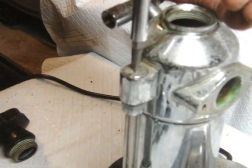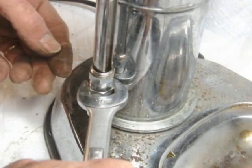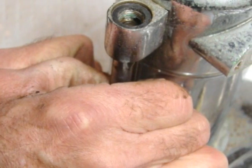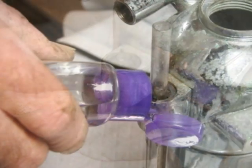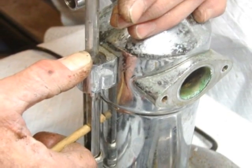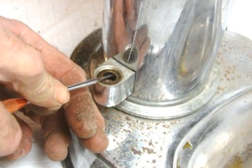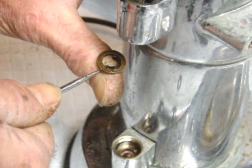Move on to the sight glass — sometimes difficult. Loosen the bolts and grasp the sight glass through the metal covering with your fingers. Twist, lift, push. Once you get it started, apply some lubricant and work the lube into the seal. Stay away from that with metal tools — a little wood stick pushes it right up and out of the top. Remove the bearing washers, the lower seal, the upper seal.